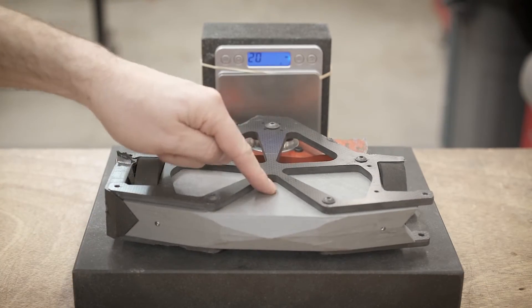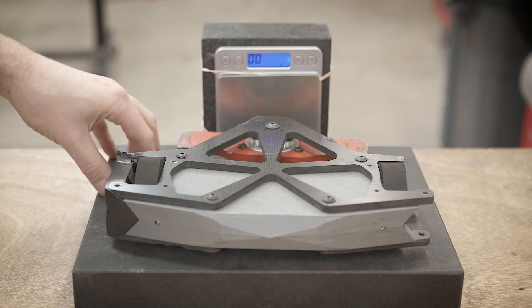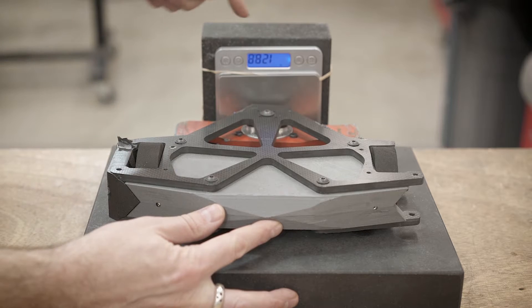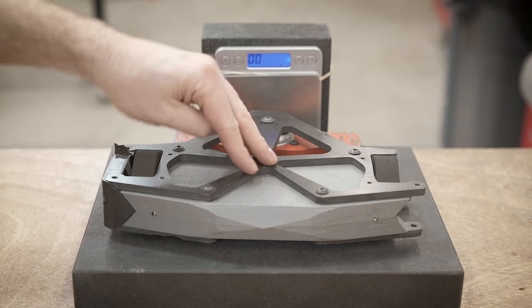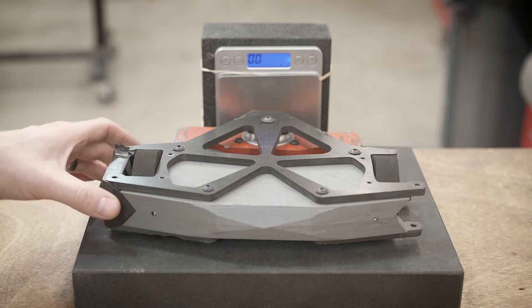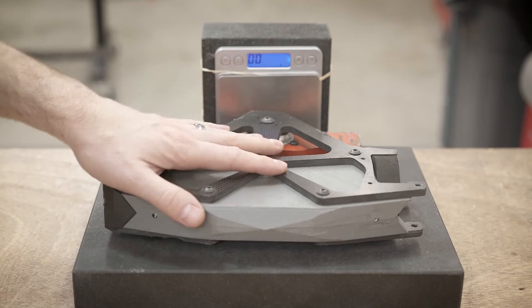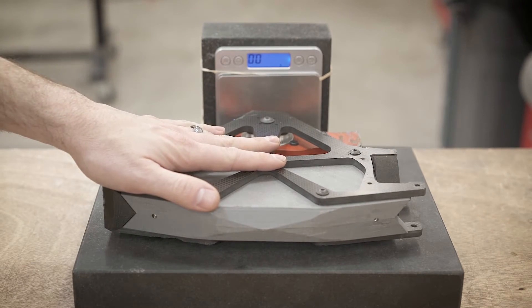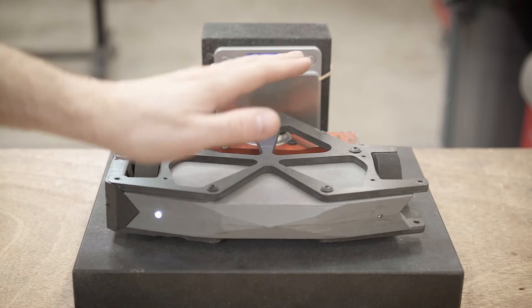So here is the lovely test setup. I've got Psychotic Brake Two on here. I've got a scale rubber banded to a granite surface block, and another granite surface block down here as the drive platform for the robot. The idea is I can just drive this into the scale and see what kind of force the robot is exerting — basically how much pushing force it has. Then we can change variables like adding some weight for more traction to the back tires, or adding some latex on the tires for a little bit more grip. This is not really a definitive scientific test, but more of a representation of how different changes can affect pushing power. The weapon is disabled; I'm just pushing against it for a nice flat surface against the scale.